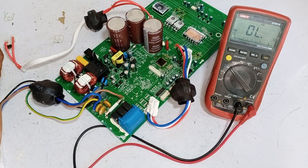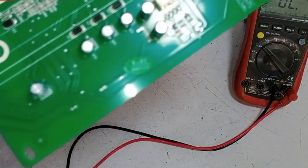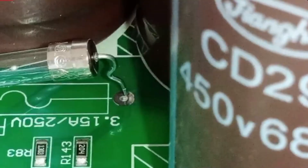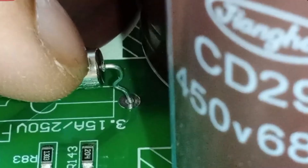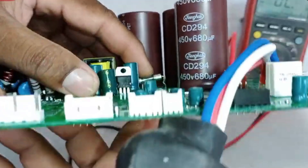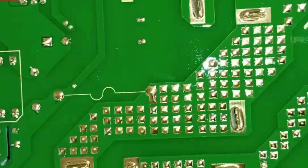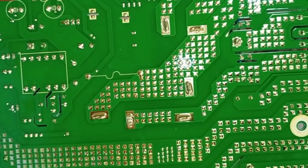However, there's one more thing worth noting. I don't know how this PCB passed the company's inspection — you can see it has a sticker, but I'll show you why this PCB is faulty. If you zoom in, you'll see a fuse that hasn't been soldered correctly in its place. Looking at the other side, you can see that the soldering is incomplete, which is why this PCB is dead. No matter how much you try, it won't turn on. This is why physical testing should always be done.